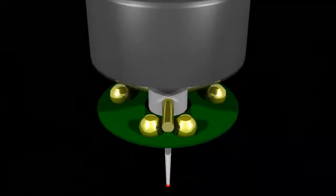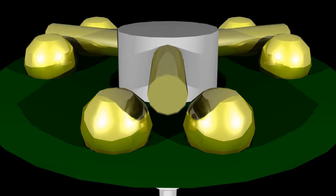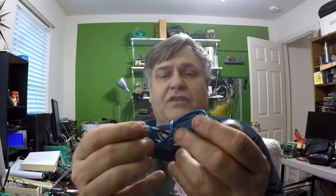This is a probe and internally it's got some little rods that sit and make contact. Whenever this thing gets bumped, one or more of the rods will break contact. But if this thing comes down and you've got a piece of material, you can go like this and you can find the edges. It can detect anything that makes it break contact. It's useful for finding the center of holes and all kinds of other things. A lot of times what you want is to simply measure the length of a tool bit. For that, you've just got some kind of a puck. In its simplest form, you've got an alligator clip, you clip it to your tool, your tool comes down, and when it makes electrical contact, that reads it. That's the simplest form.